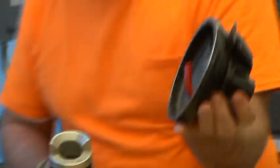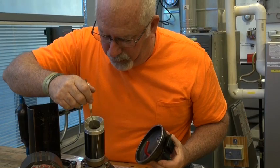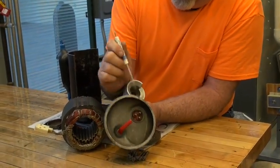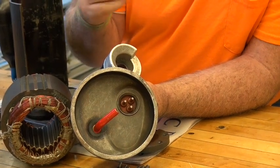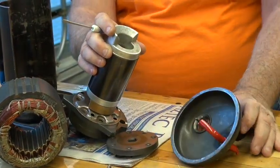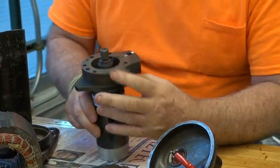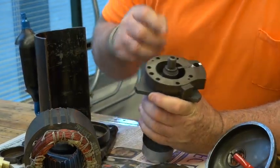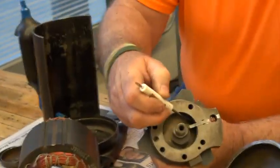When it hits that — remember, your cover is on this. For simplicity we had to remove some things, but this pipe goes and joins this little piece down in here, so all of this is joined together. This is separate from the motor because, of course, if the motor turned it would tear the copper right apart. At that moment the refrigerant is in there, and you can take out the sleeve that's in there — or it just may fall out — and you'll have a better picture of that valve that we were talking about.